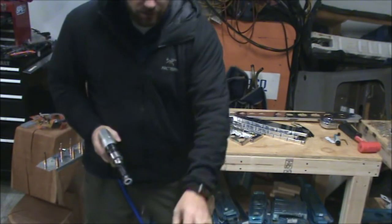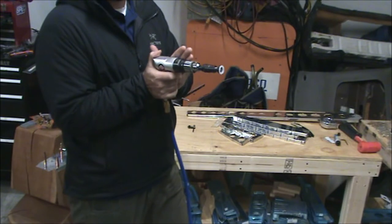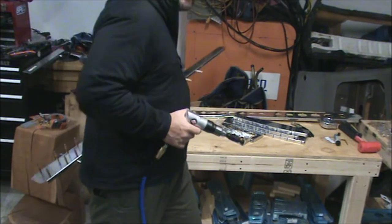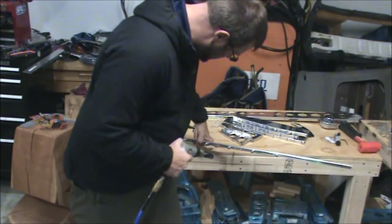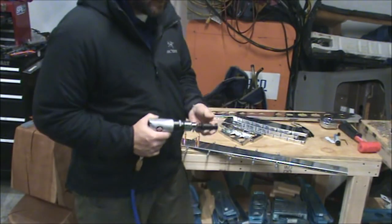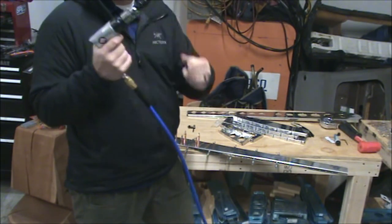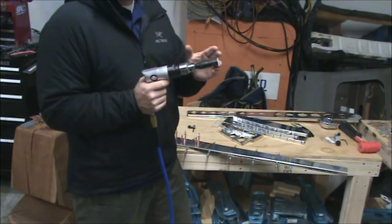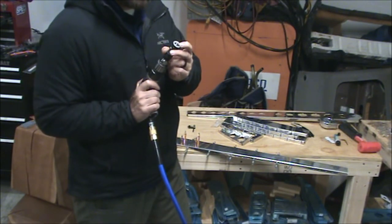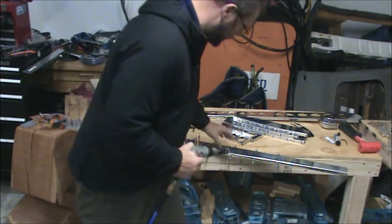Eventually I'll get to where at seven clicks I should be getting the skin laying flush against the spar. If not, I'll go a little bit deeper until I get that skin laying flush against the spar, and at that point it's set up correctly. You lock it down and you drill your holes. Every once in a while you should check this thing to make sure it hasn't gotten out of adjustment or that you're not pressing too hard, and do a fit check.